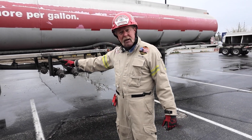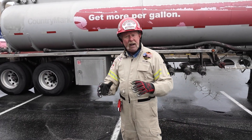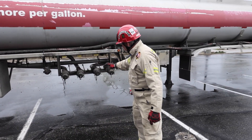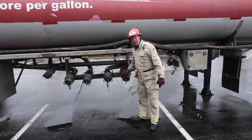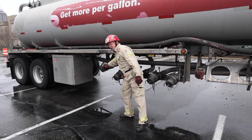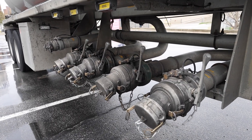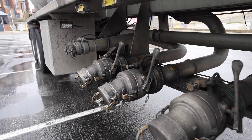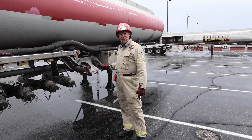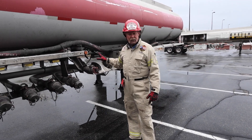This large compartment you see here is typically for fittings, cones, and safety items for this tanker trailer. Moving along, these are known as the external valves — this is what the hoses connect to. These are part of the vapor system, and they all connect together and go up that pipe in the back. There are three different places they could connect their vapor line to capture vapors from the tank, all connected together.